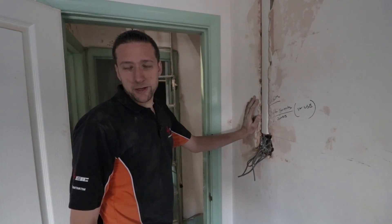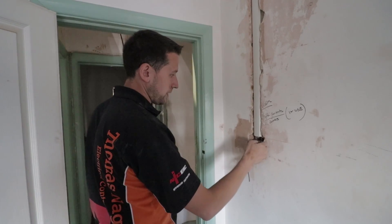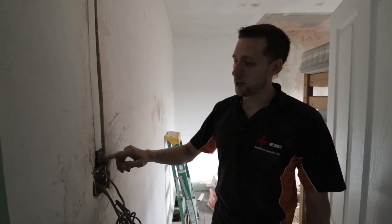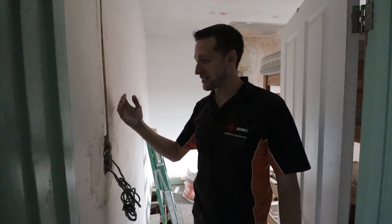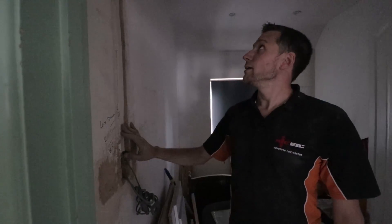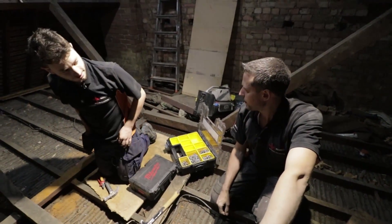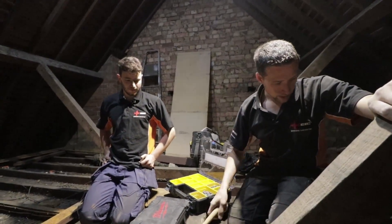So we are about five o'clock on Friday now. Tom's just upstairs clipping the cabling in. These are the new runs which have gone in, so we've just got our capping on now. I've dug these out a little bit deeper because the boxes were proud of the surface, so I've set them back a little bit. I've used a deeper box in here because they've got vPro dimmers going in. All of the wiring is now run through the joists and everything — it's just a question of clipping it all in now.